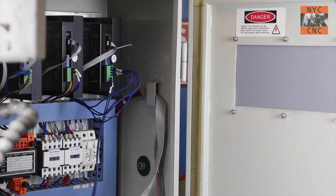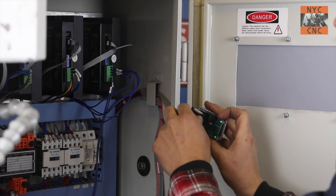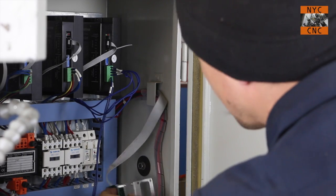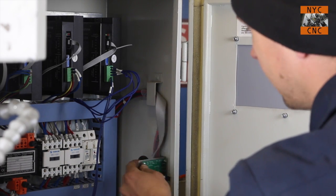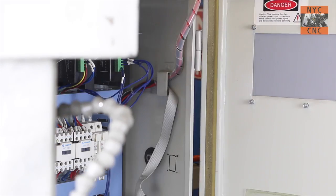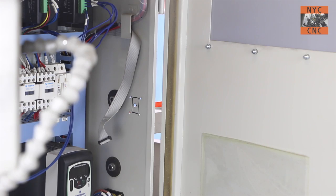The directions say to mount the little circuit board that came with the relocation kit and the existing DIN connector on the left side of the panel. It's a little hard to figure out exactly where they mean in the manual. I assumed mid-height on the left side. You want it oriented so you can see the two LEDs, but not so far out that the door won't close. I used a one-inch hole saw to make the clearance hole in the sheet metal.